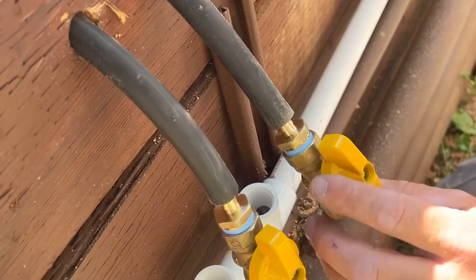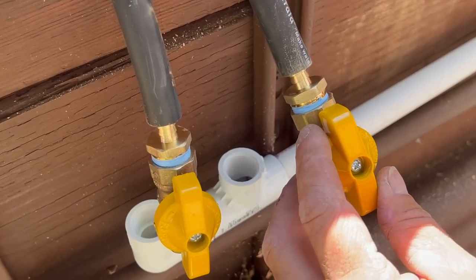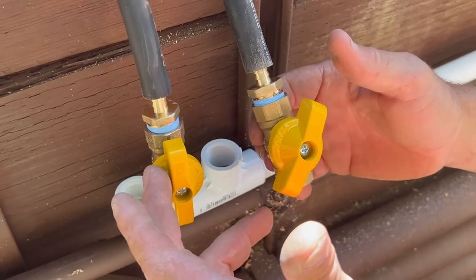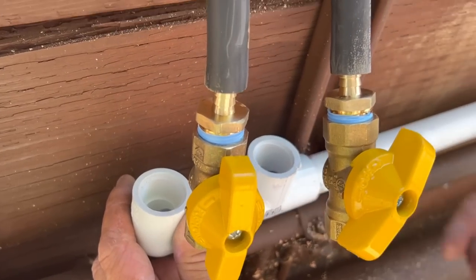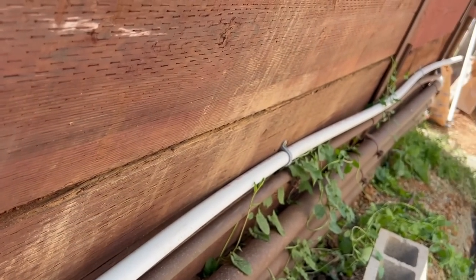And what are those valves for, dude? So these are our air valves. Say you want to move your diffuser to a shallower area. Well, there's less water pressure on that diffuser. So you can restrict the amount of air going to that diffuser to force more air to the deeper diffuser. And these are going to tie in here. We got to get some strut clamps to mount this so it's nice and stable. So that hose goes all the way down the side, and then we'll put our air pump in the back.